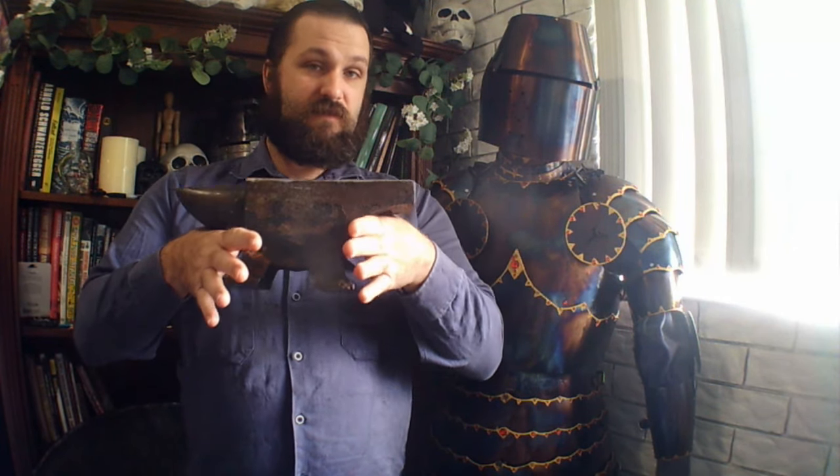This is just a 10-kilo hobby or craft anvil I got from a local hardware store - probably the most expensive tool on this list. But if you can't find a hobby anvil, all you need is a big chunk of mild steel - maybe a piece of square bar that's two inch by two inch. That will work if you can polish up the top of it. You also want to make sure it doesn't bounce around a lot, so if there's a way you can anchor it down that's really good.